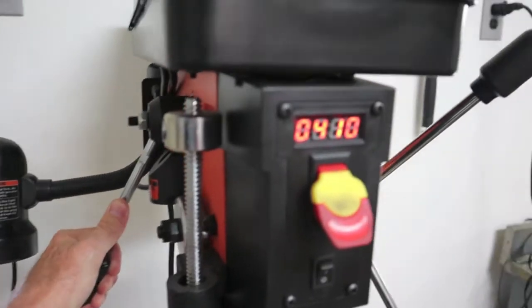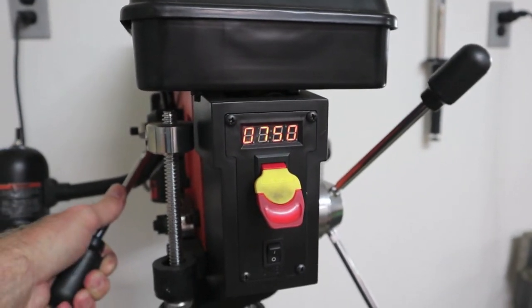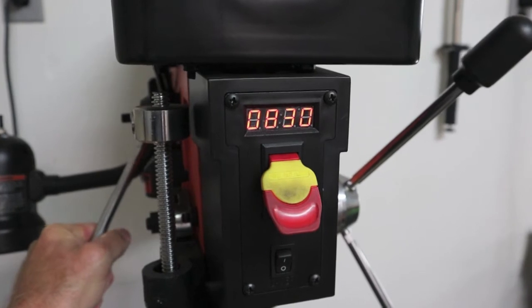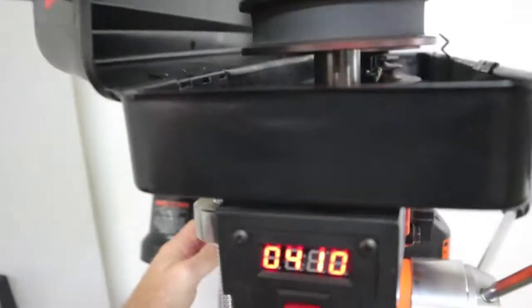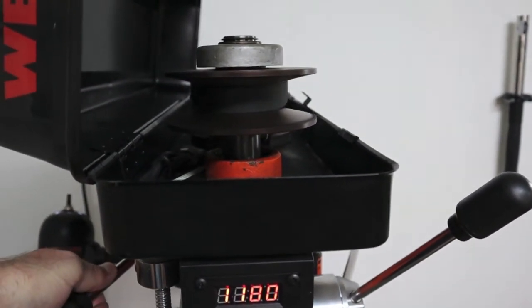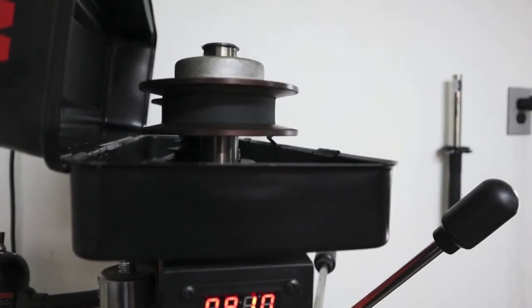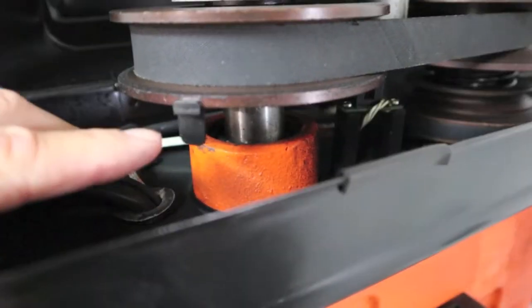Speed her up. Slight lag in the RPM reading, as you can see. And it is two speeds. This takes it up so fast, then you can switch belts. See the belt suck in, I'll watch it come back out. Blowing her down. There's a little Hall effect magnet that picks up the speed and puts it on the display. There's a sensor that it goes through.